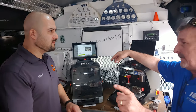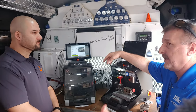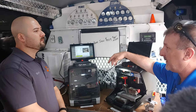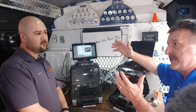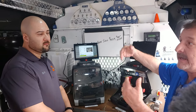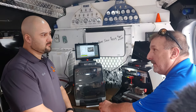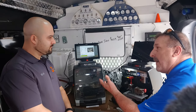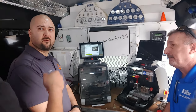In that situation, if they're up over 1,000, it's probably because they're constantly cutting the same brass type. Same type of key. Soft key. But if you cut OEM keys, maybe a little bit harder. Exactly. Material. If you start to see a variety, especially where you're getting keys from, you could see a variety in the hardness of the steel. That's going to obviously affect the life of that cutting bit. But like I said, those steps too will help reduce that.